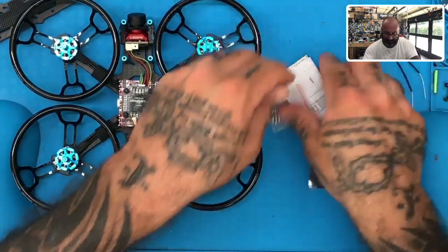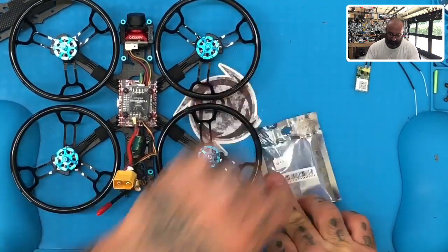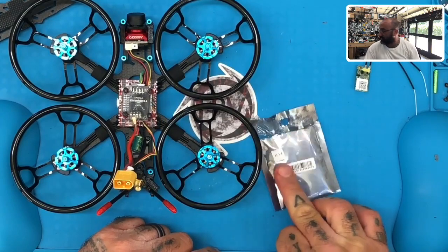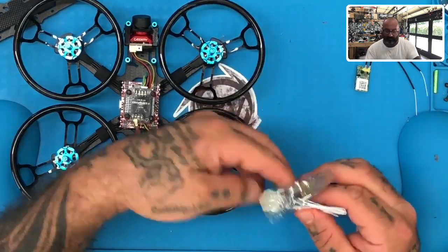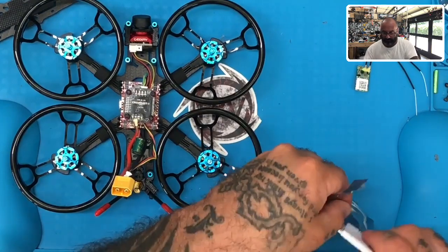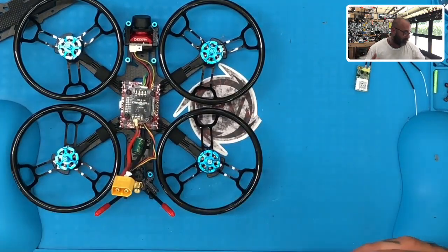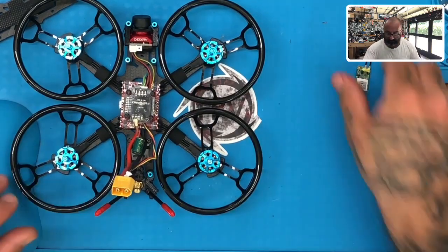Go ahead and take just this part out. And if you'll notice here, the XM Plus, the new ones that are coming out, come with V2.1.x. This means that you do have to upgrade your ISRM or your internal RF module to the 2.1.x version. All right, now we're going to put this aside and give that to the customer.